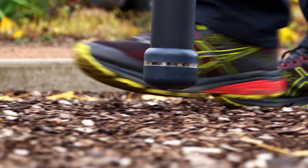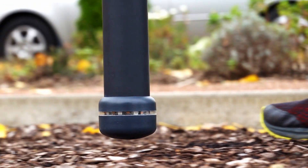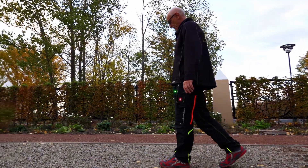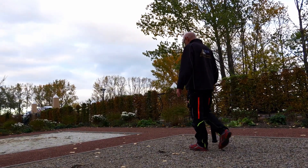Keep the measuring points as accurate as possible by measuring each scan line always at the same speed — walk slowly to collect enough impulses. Walk the scan lines at the same speed. If a constant speed is not possible due to obstacles in your scan field, you might try the manual impulse mode.